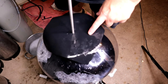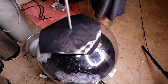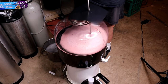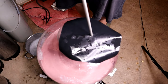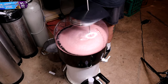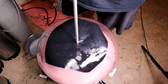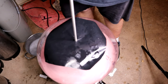You don't want to be bashing on the bottom — once you hit the bottom just lift up a bit. You don't want to or need to go flat out — just a gentle stir will degas it nicely. Thirty seconds one way, then go the other way, back and forth. If you do that about eight times, you want to do it for about four or five minutes.